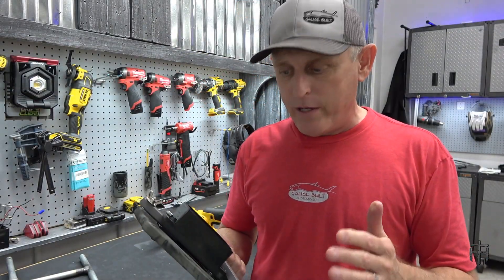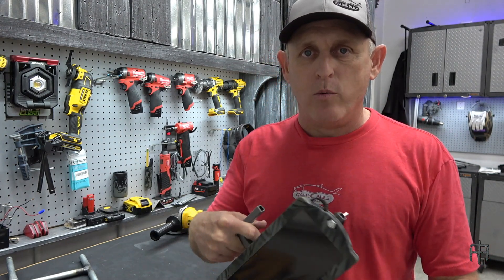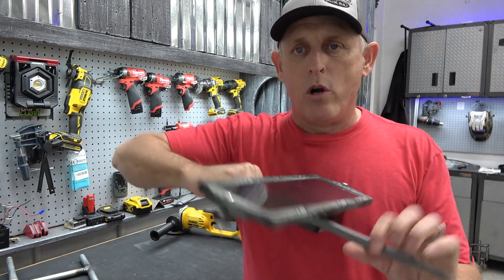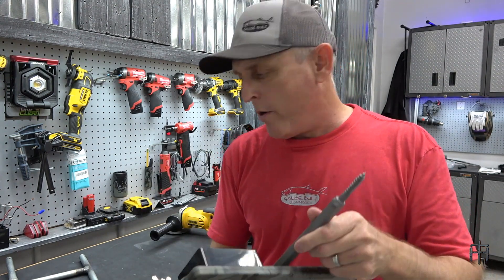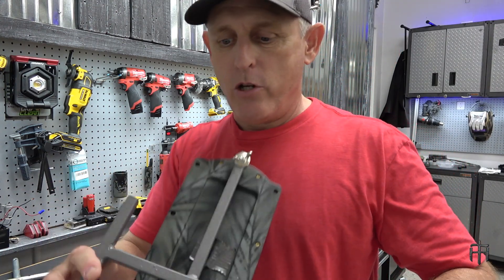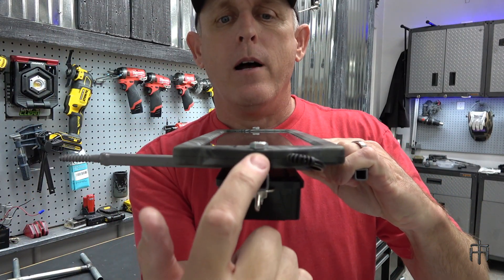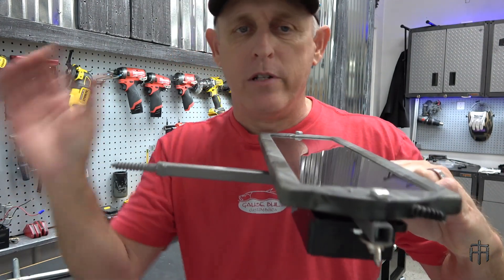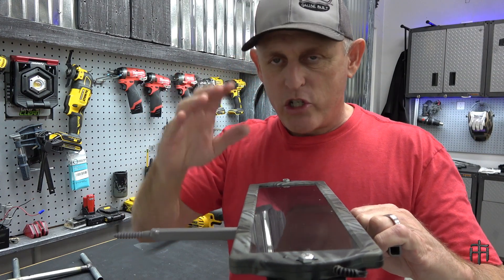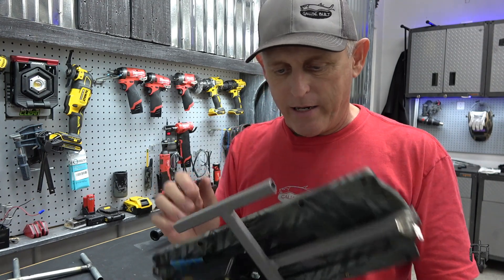So we're going to walk you through this. What I'm doing now with these setups is I made a couple of upgrades. One is I put a handle on them because it gives you something to hold on to when you go to screw it into the tree — just makes it nice and easy. I also switched to the square bar, half inch square bar. The big benefit of square bar is the bar is flat, so your solar panel rides right on top of the flat surface and your battery box mounts to the flat surface too. Everything sandwiched together is a nice tight sturdy fit, and all your welds are straight flush cut welds — no radiuses. Just the way to go.